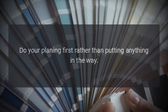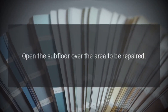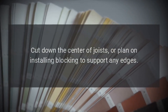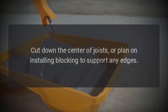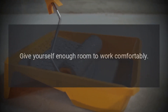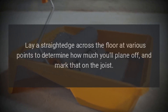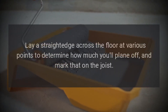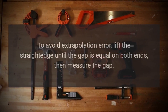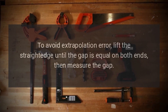Do your planing first rather than putting anything in the way. Open the subfloor over the area to be repaired. Cut down the center of joists, or plan on installing blocking to support any edges. Give yourself enough room to work comfortably. Lay a straightedge across the floor at various points to determine how much you'll plane off, and mark that on the joist to avoid extrapolation error.